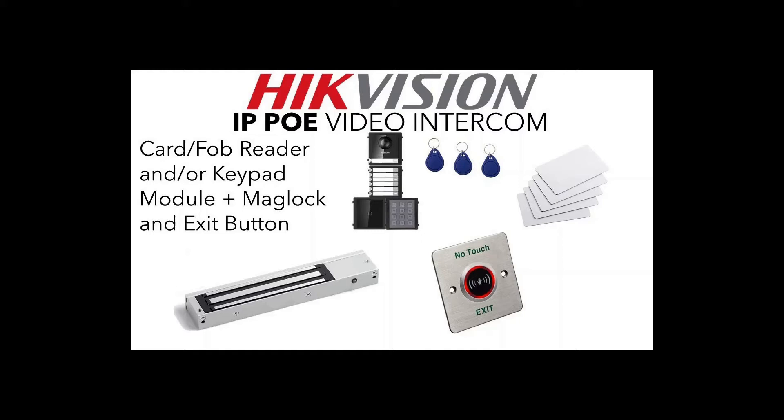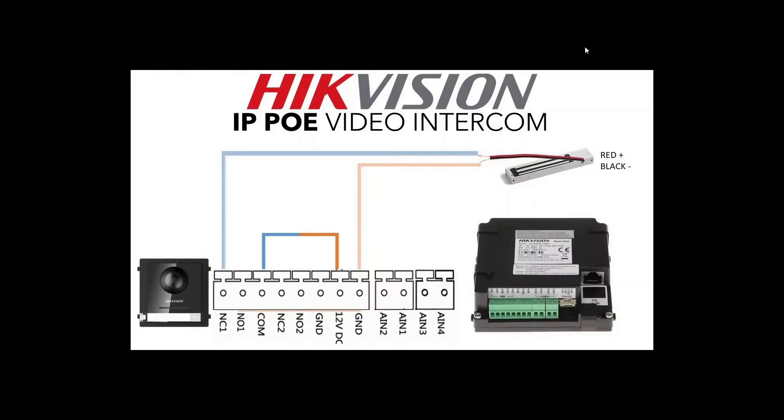So let's look at our wiring. This is our little setup — we have our main unit, our door station, and all we've done is connected it to a mag lock. A mag lock has two cable outputs. I used a piece of shotgun power cable — it's just two cores. You can use cat cable; I just used red for positive and black for negative. You open up the little portal in the mag lock and there's a screw terminal for the cable to wire up positive and negative. So as you see from our diagram, all you have is three cables to wire up.